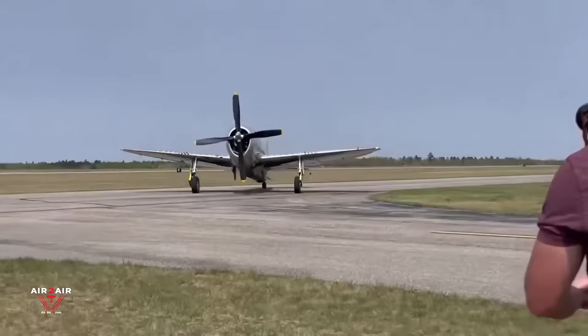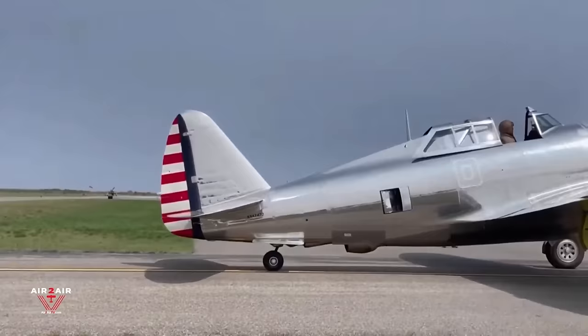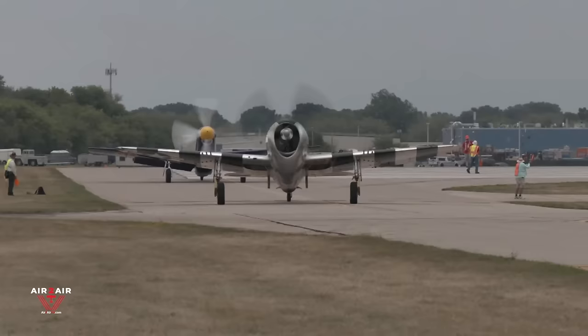A couple things are different. The propeller was not designed, that blade wasn't designed for the airplane. It might not be the right length. But the big thing is it doesn't turn as fast. On later airplanes, you turn the propeller slower and turn the engine RPM up, you get more brake horsepower, but it's slower to accelerate. So during the first test flight, we briefed it all up.